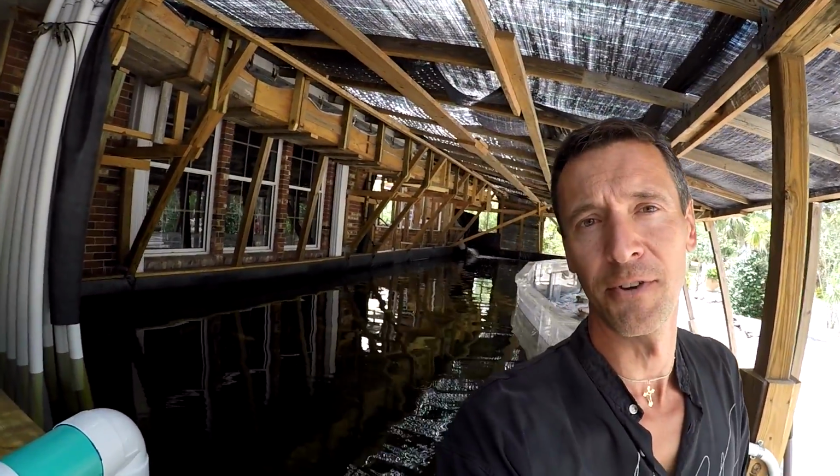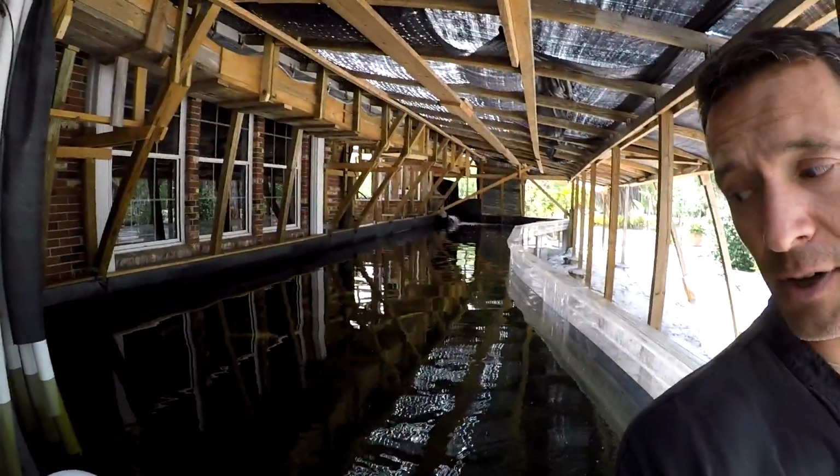Hi everybody, in this time-lapse video we're gonna show you how we've done the koi pond exhibit filter and the piping and the water turnover. This is a 25,000 gallon pond exhibit, and 25,000 is to the brim, so right now it's filled with only 20,000 gallons, and we're gonna aim for 3 turnovers an hour, which means 20-minute turnover, and that also means 60,000 gallons an hour flow rate.